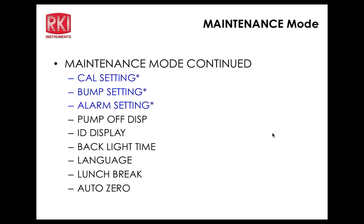All right, Tony, talk to me about the Port Authority. Yeah, you're right. That came up with them. For some reason, they wanted to see extremely low levels of CO, and they objected to us having the zero suppression. So you could go back to them with this instrument and be able to read right down to 1 ppm for CO. That's great. What it does, Daryl, the way the zero follower operates is if the instrument goes negative for a period of time, I think it's 1 minute, it knows that the negative reading is not possible, so it'll bump the reading back up to 0.